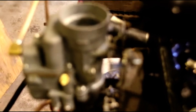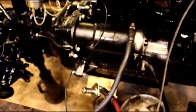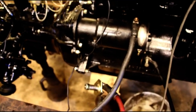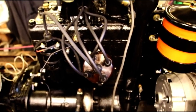The timing is set and the carburetor is adjusted. There's no air cleaner hooked up or anything like that, so you may have to tweak the carburetor idle just a bit. This is based on Connecticut air — depending where you are in the country, your air is going to be different and your carburetor may need just a little touch of adjustment. Timing is five degrees before. If you feel you need to change that, if it doesn't feel like it's pulling hard enough, you can tweak it just a little bit.